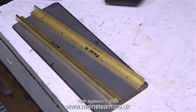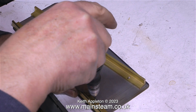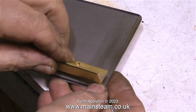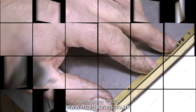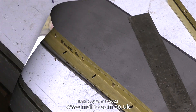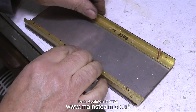I've been doing this for quite a lot of years, so I can make a felt tip pen mark, drill holes there upon, and the parts are more than accurate enough. On the brass angle I've written 'base R' and 'base L' - that's base right and base left - and on the stainless steel mounting plate I've just written L and R for left and right. What I'm doing is making a mark on the metal plate, drilling it all the way through in the drilling machine, and popping a rivet in. Then I make a mark through the hole with the Minicraft drill at the other end as well. This ensures that the brass angle is perfectly parallel to the edge of the plate. Before I permanently fix the brass angle in place, I have to drill some more holes in it, doing this freehand - remember what I said about the calibrated eye. By using a couple of rivets to align the parts, I can then drill the holes all the way through the steel plate using the brass angle as a guide.